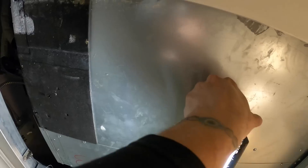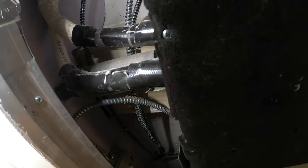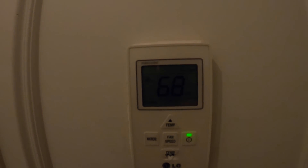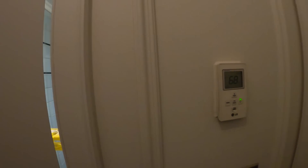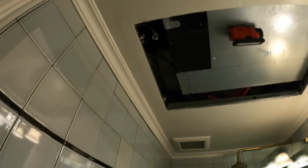You've got two refrigerant pipes and then the one in the middle — that's the drain line that's insulated. Sometimes when the pump goes bad, you might get an error code. Like if the float trips and goes all the way up. I don't see any errors there. We've got to see what's going on here and take off these covers.